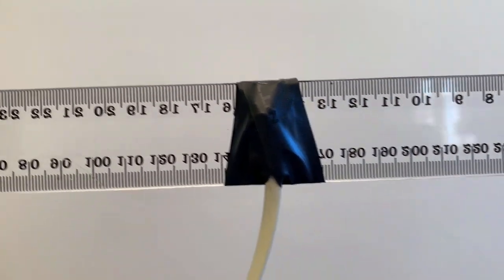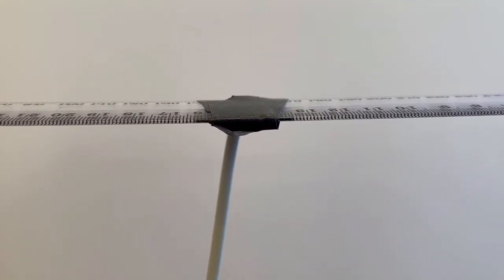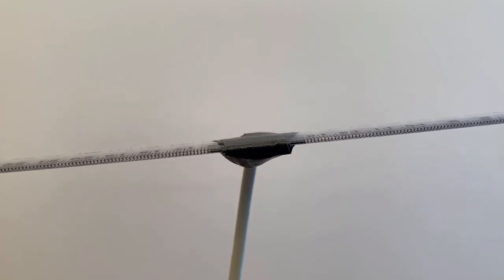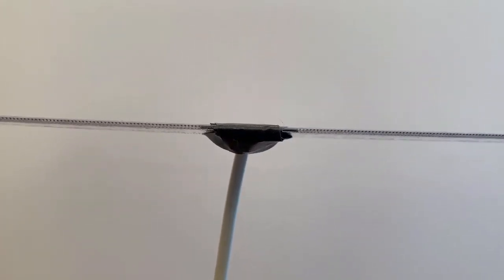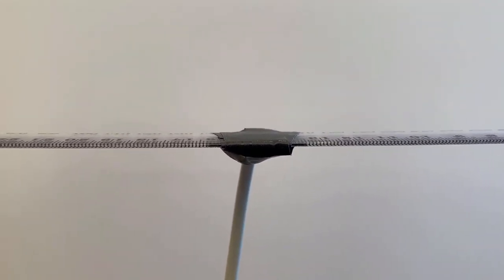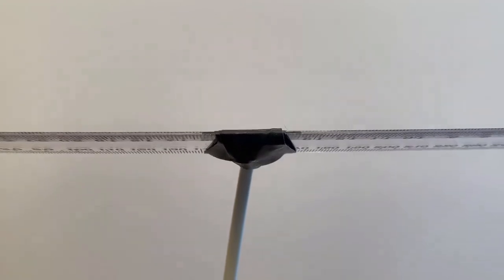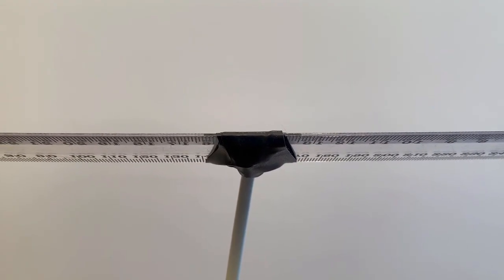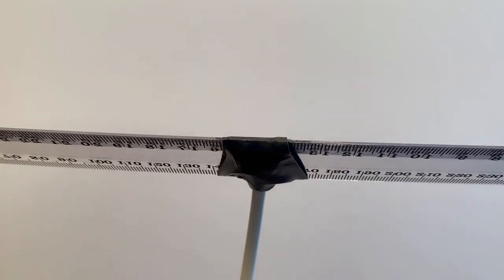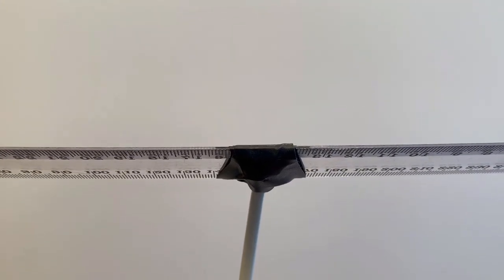Now I focus on the bottom side of the sensor. I point the bottom side of the sensor vertically and search around until SarkTrack stops beeping. This is point number 11 complete. Next, I point the bottom side north at my local magnetic inclination and search around again until SarkTrack stops beeping.